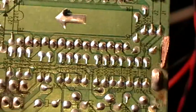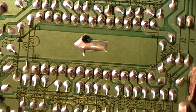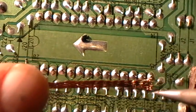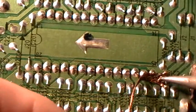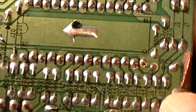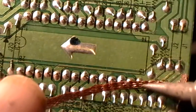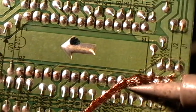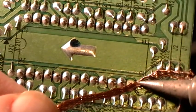So there's the footprint of the IC from the backside of the board. You get your soldering iron and you start attacking the pins one by one with the hot iron and the desoldering braid. As you'll be able to see, the solder just wicks right up from the pin and it often leaves the hole quite free.